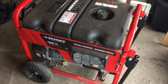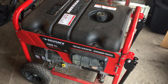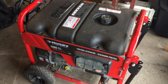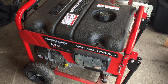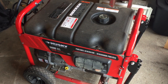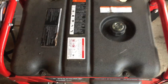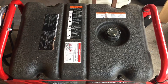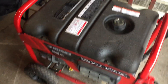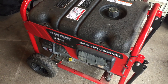That's one of the reasons I like this setup. This generator — I did a couple of upgrades on it, and one of them is I converted it over to propane. It runs on either propane or gasoline; I've got it set up for propane right now. One advantage I like about propane is it starts fairly easy and you don't have a tank full of gas on top of it. When it had six gallons of gas in it, it was very heavy and hard for friends and family to move around. It's much lighter now running on propane.